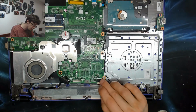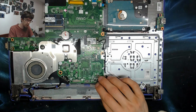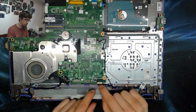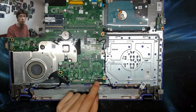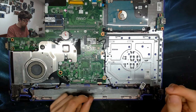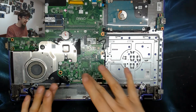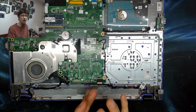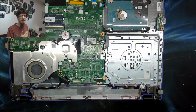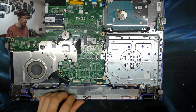Because we've got a dead short directly on the DC jack, I'm expecting to find that short circuit fairly close by, because on a typical laptop, your power comes in through the charger jack into the board at DC in, and then almost immediately it will go through an inrush limiter, which will be one or more MOSFETs that just basically switch in the main power input, and they allow the laptop to switch off the incoming power and things like that. It also just makes sure that you can't get sudden surges, and it's just first level filtering. Not very sophisticated, but just sanity check filtering.